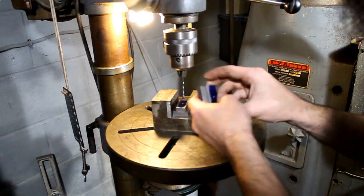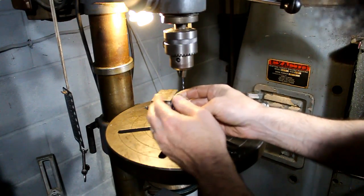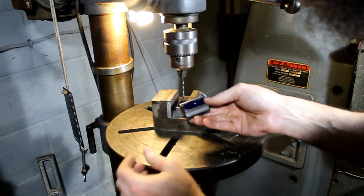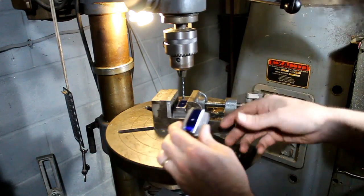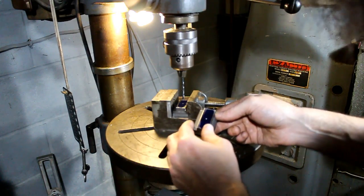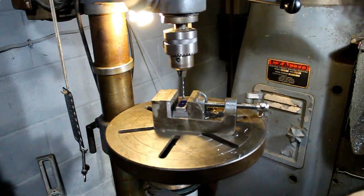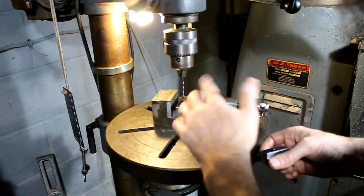Alright guys, now I ended up with eight T-nuts, 2 from a previous attempt at building some. I'm going to tap 6 of them 1/2-13, and then I'm going to tap 2 at 3/8-16, just in case I need to bolt through something that has a small bolt hole. So that's the plan. We're going to drill them all first with just a small pilot drill.